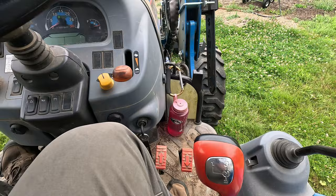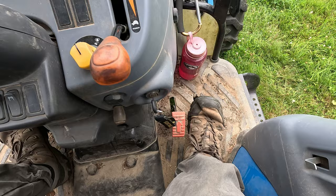The only real benefit of a manual, especially on a compact tractor, is if you're doing a lot of plowing or tillage — there are some grading applications where it's more helpful. But by and large, a hydrostatic or automatic transmission on a tractor is way easier for just driving around, doing jobs, and doing loader work. Whereas a manual, you may get a little more power to the rear end — but you could always just buy a higher horsepower tractor with a hydrostatic transmission and have a lot less headaches, and in reality less maintenance in the future. For a hydrostatic tractor, we're going to pick a range, pick forward or reverse — and it's that easy.